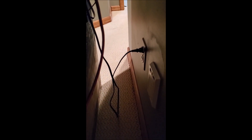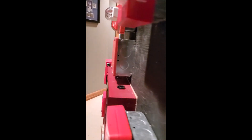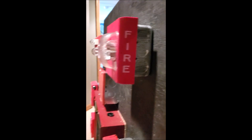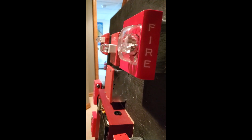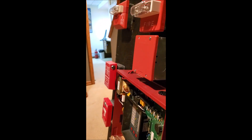The fire alarm panel gets power from an old lamp plug that I cut, and you can see it just plugs directly into a wall outlet. The whole unit gets power from that. You can see the NAC circuit comes out of the panel and goes into the sync module. Then from the sync module, it goes into the two Wheelock devices, and then finally to the Faraday device. So I just want to reiterate that during the test, the two Wheelock devices will sync, but the Faraday device will not sync because it is not compatible with the Wheelock Sync Module.